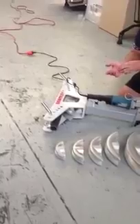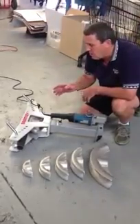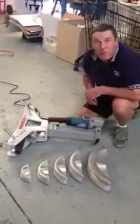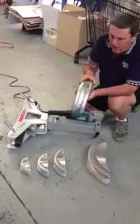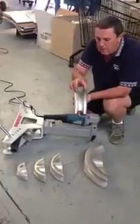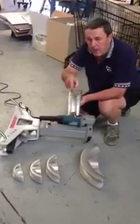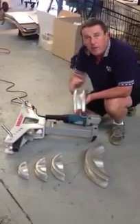Just hold the pipe in the former until it comes out onto the rollers and pull the trigger. It's now starting the bend. It's very important that you do not bend past 90 degrees — the machine is designed for a 90 degree bend. If you take it past 90, you put increased pressure on the corners of the former and you will break the casting. Like the manual unit, these use the Bramley aluminium alloy formers of an elliptical form, meaning that when you put the pipe into it, it doesn't go right to the bottom — it sits just a bit above it. When the pressure comes on, it forces it into the former, and if you cut through the bent pipe at the end, it would have an elliptical form, which minimizes the crinkling on the inside of the bend and flattening of the outside of the bend.